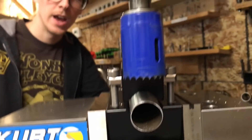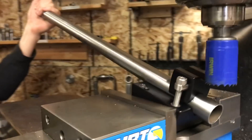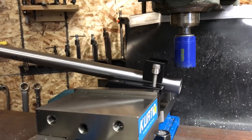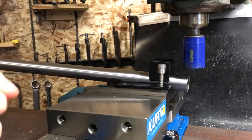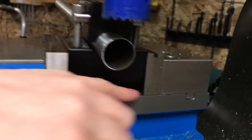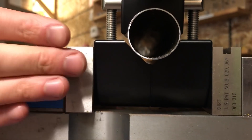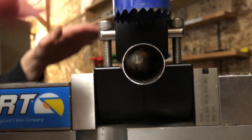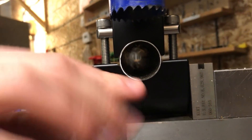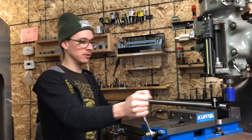As you go to adjust the angle, it's got this point of rotation — not functionally necessary, but it makes the whole process a lot nicer. The whole tool is lifted up, so if you have chips on the bottom of your vice from previous cuts, it's not going to be sitting in those. It also locks the tool in the X-axis and Y-axis, so all it's really doing is pivoting up and down, not around the tube centerline. It just gives the whole thing a nicer feel when adjusting the angle.